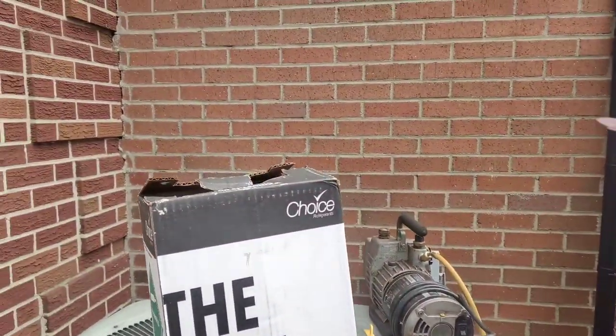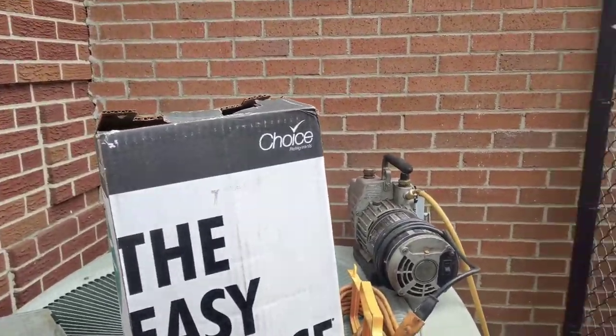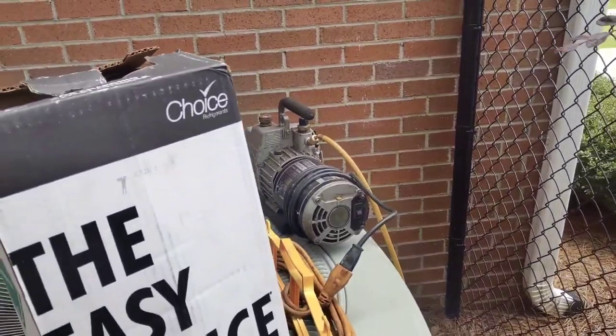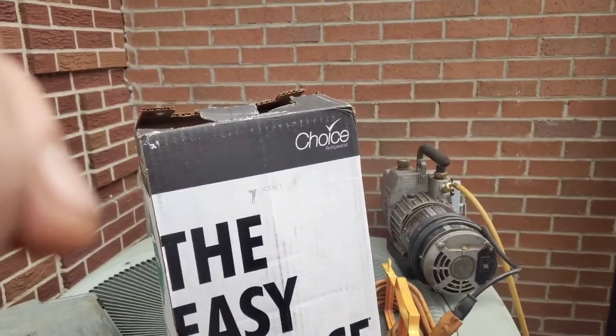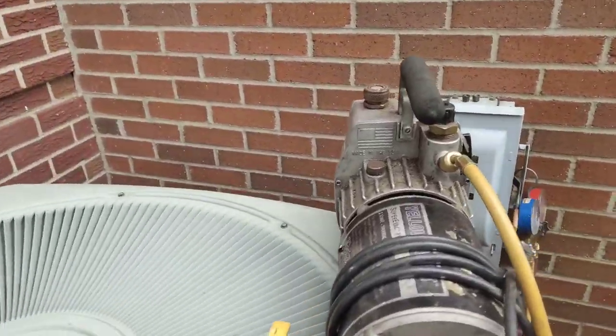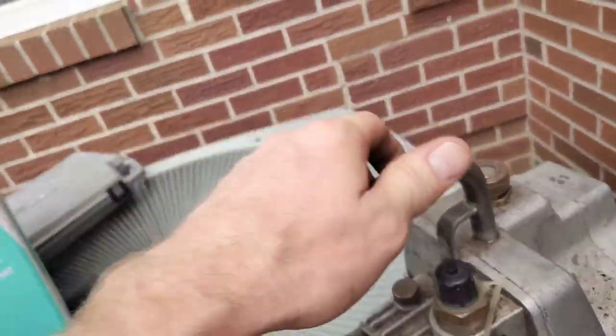It might be a Monday or a Friday, okay? And check the factory flares and make sure they ain't leaking, because I found that on a lot of jobs too, okay? That's a beautiful thing right there, ain't it, y'all? Especially when you had a rough time getting into the refrigerant system, changing the indoor coil, that is a good thing. When you got your vacuum pump running, Jesus, that means we didn't have no leaks.